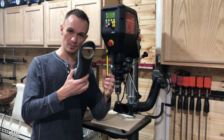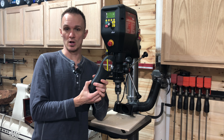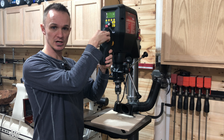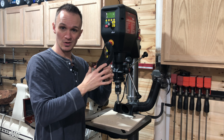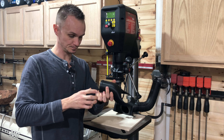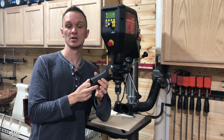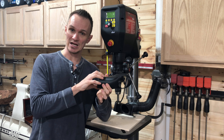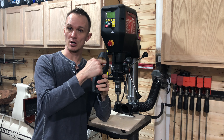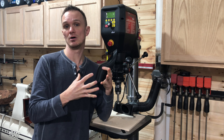The design I came up with was based on something used for drilling drywall with a shop vac — it would normally hook to a shop vac and you drill through it to collect the dust. That type of drilling was a lot smaller, and I wanted to be able to do something a lot larger and also hook it up to a two-and-a-half inch port. So I enlarged the design: this will fit into a two inch port as well as allow for really large Forstner bits to drill in here and still catch all of those shavings.